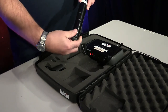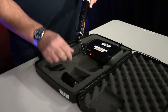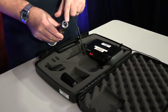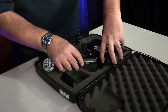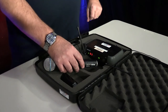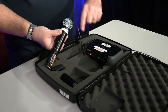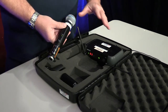What we are going to do is unscrew the bottom of the mic. At the bottom of the mic there is an infrared receiver, just like a remote that you would have for your TV. We are going to hold it right up where this big button is, hit the button, and it will sync this unit to the handheld unit. Now if we tap on it, you will see we have the light — so now this is talking to this.